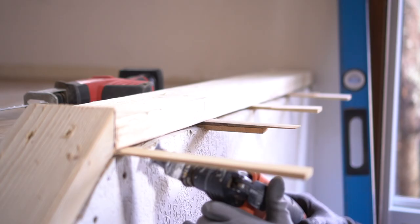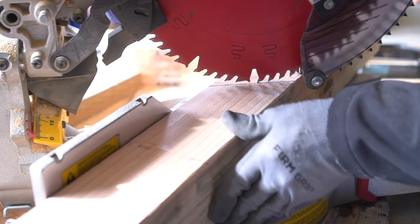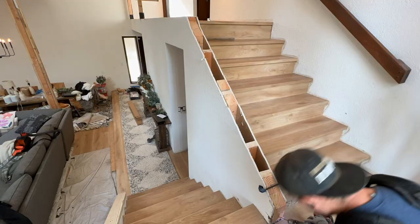Make sure you're cutting the excess shims flush with your framing using a utility knife or a multi-tool. I also use my reciprocating saw to remove any excess for a perfect transition between the stairwell and the flat landing area. For the second stair set it's the same exact process — making sure we have proper four-by-four blocking at the top, bottom, and middle sections, then providing a proper top cap for the entire structure made out of the two-by-six cut down to four and three-quarters.